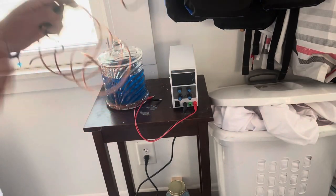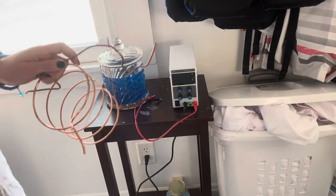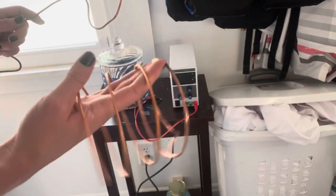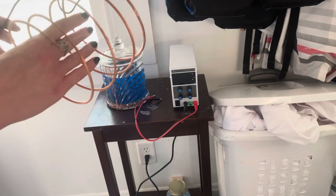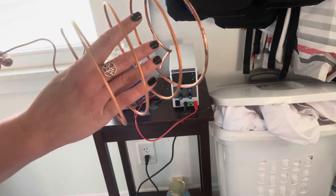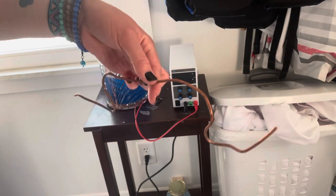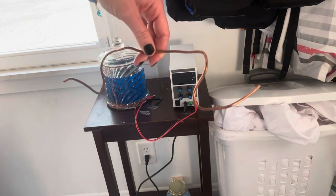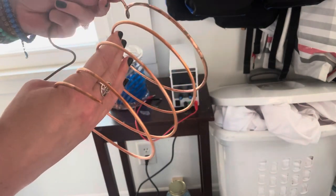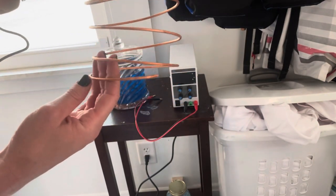You will also need three different pieces of pure copper wire. The first is a pretty low gauge — remember, lower numbers are thicker wire — so about 8 or 12 gauge pure copper wire. This sits over top of the electroforming bath. And this is the copper coil that you're going to put into the bath for it to draw the copper from.